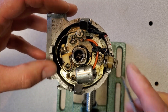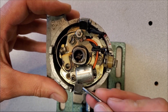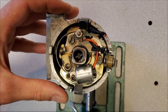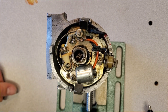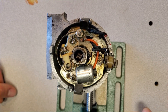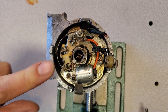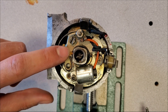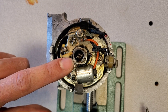I also noticed that the breaker plate doesn't move — it's stuck. Even if this car had a vacuum module attached, it would not operate the breaker plate. So I'm going to take apart the top half of this distributor and see what's going on. I'm also going to measure this wear and tear and try to show how much change was occurring with the dwell angle because of the wear.